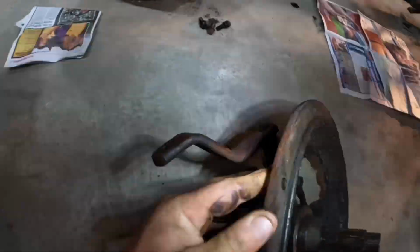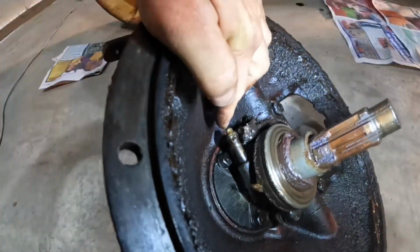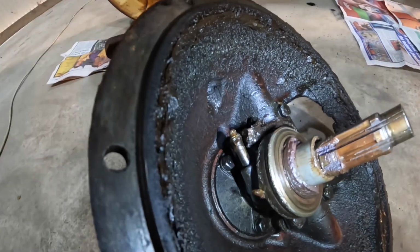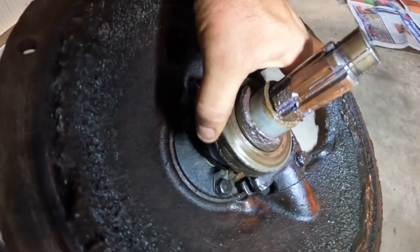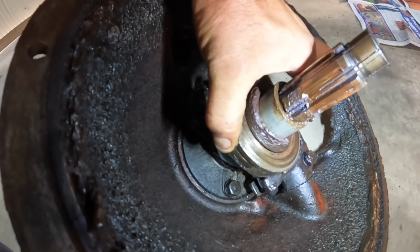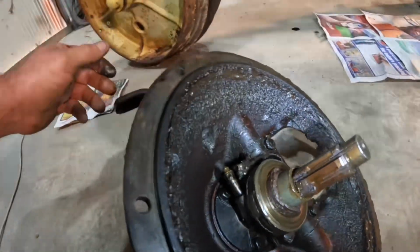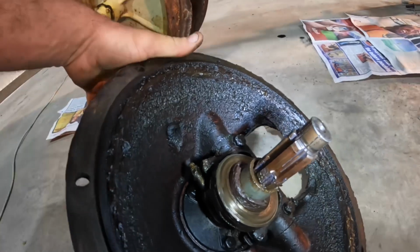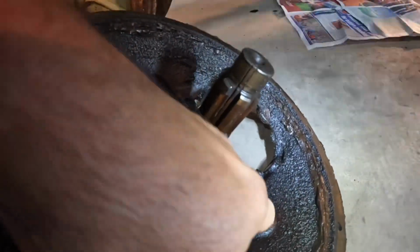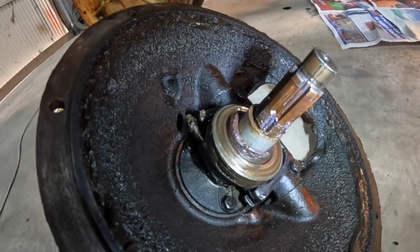There on the outside here, there's a funny bung that I had wondered what was for. And if we look inside here, there's a grease nipple that you need to take that bung out and grease. That's for the clutch throw-out bearing, which is here. That's not great, that bearing. So the reason the clutch isn't working is actually because this cross shaft here has seized up somewhere, I think on this side here. So a bit later on we'll take that apart and free that up.